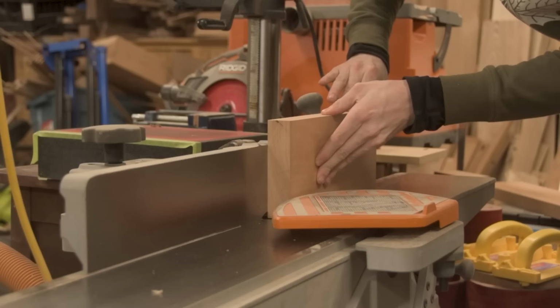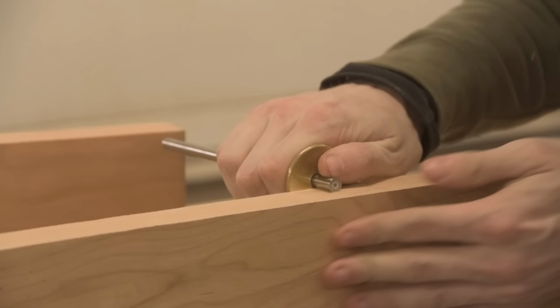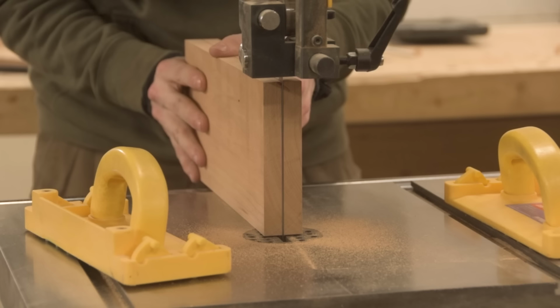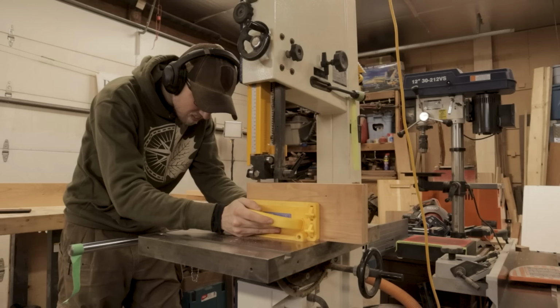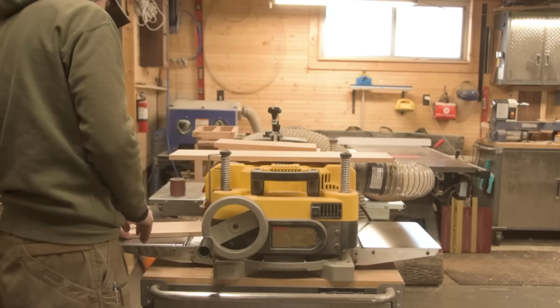Again, this worked out just perfectly. I actually have another video on my channel about building a toolbox, and what I found when I built that one is that you really don't need as thick a material as you might think. On that one, I think I used 3/4 thick stock for all of my sidewalls, and it was solid white oak and very, very heavy. So for this one, I decided to go with 5/8 inch because I did want a decent amount of strength in there. This is not a toolbox that you're going to be carrying around all day, but I still wanted it to be nice and strong, but still lightweight enough that I could actually move it around when it was fully loaded up with tools.